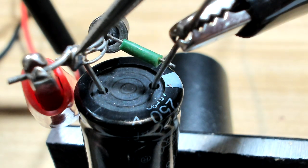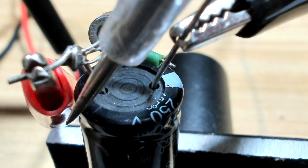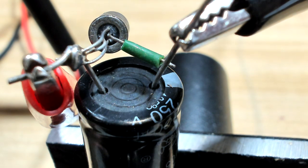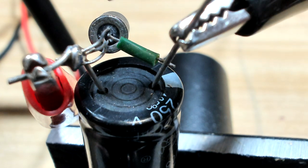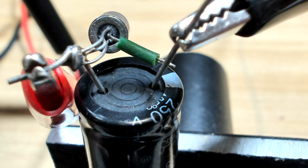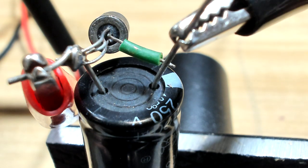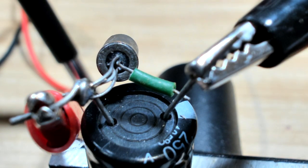I've got the shop DC power supply on there - that's on the positive side, and I've got the negative side on the negative side of the capacitor. I don't think it makes any difference as far as the transistor is concerned. I'm going to put the shop power on and push this together - we should be able to see a spark. If you see a spark it's obviously done something. The article says these things are made of glass and you might be lucky enough to see a flash. Mark also says to use 30 volt power but I've only got 16.